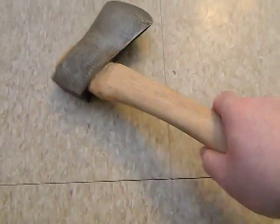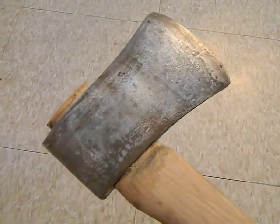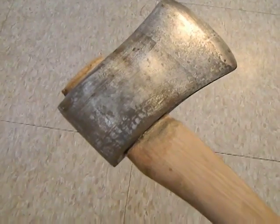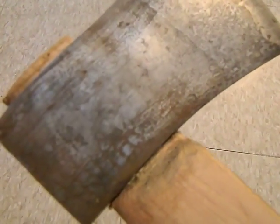This one I decided to do something a little different. It actually had a really hard black rusty scale on it, so I ground it down to shiny metal and then forced a patina with mustard. As you can see, the white marks where I wiped the mustard on left some interesting designs, and you can see a little bit of the hammer line there.